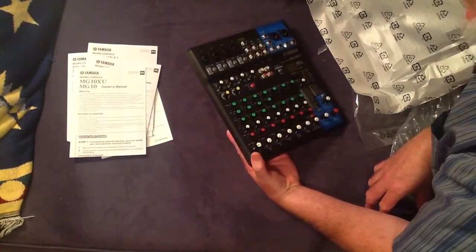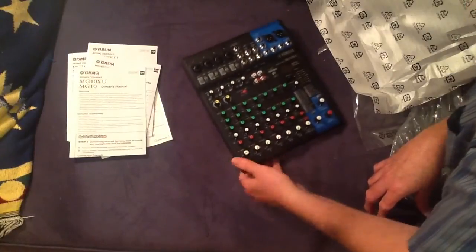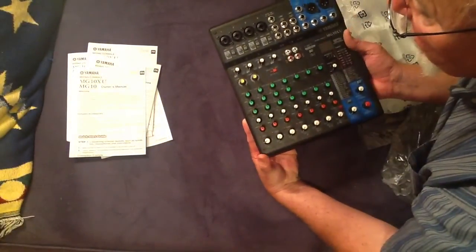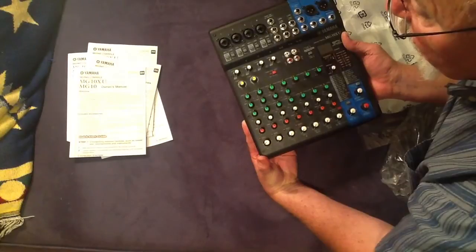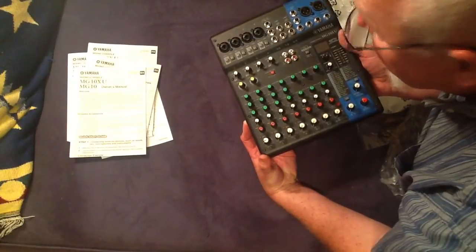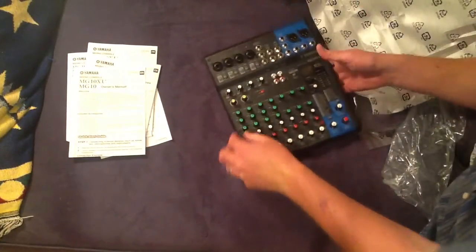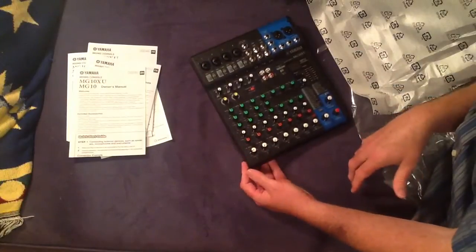It has high, mid, and low EQ, and those don't look sweepable. It looks like it's a shelving EQ, if you're familiar with that terminology. It's a, let's see, that's probably too small to see. The high will give you 10 kilohertz, either plus or minus 15. The mid-range is 2.5 kilohertz, plus or minus 15, and lows 100 hertz, plus or minus 15. The 2.5 is kind of somewhere around the sibilants in vocals, like the S's and so forth.